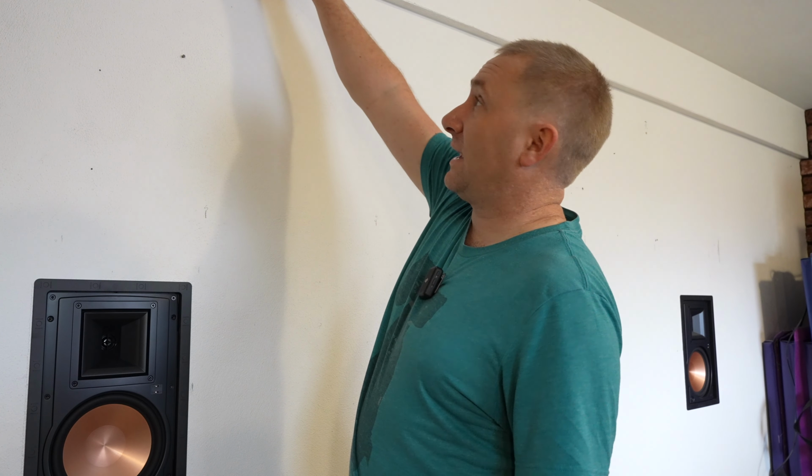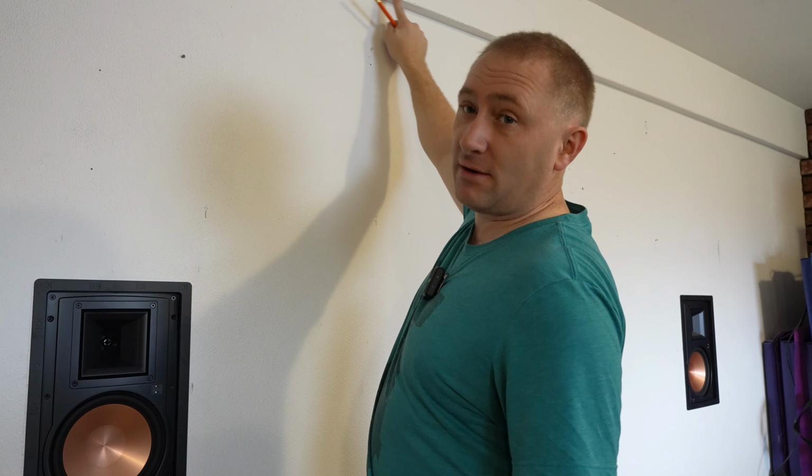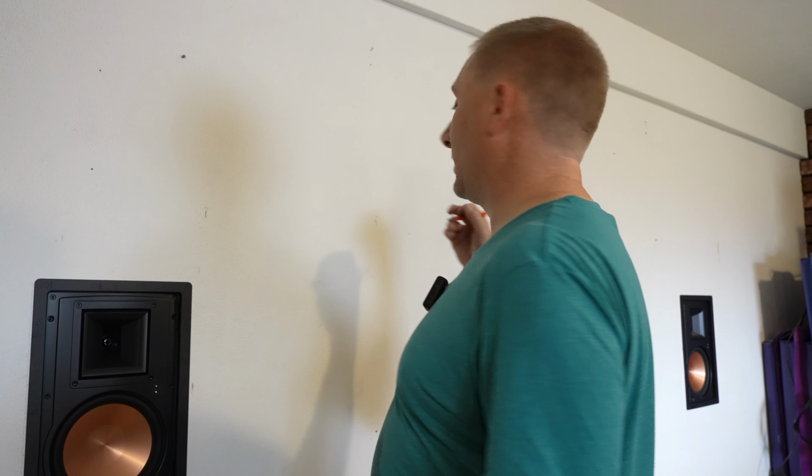You will notice though if the gap between, like in my case, I have this beam here. If I see a quarter gap on one side and an eighth gap on the other, that's going to be a lot more noticeable than if I was off level by 1/8 of an inch. So based on your wall, obviously just make the right assumption. If you have a long level too, I do have a 6-foot level. I could do that real quick just to verify I'm about level. But I'm going to go by looks, actually, in this case.